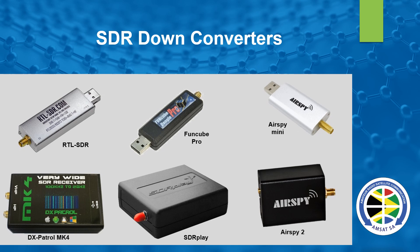You can have a whole lecture just on these SDR receivers, but it's really just a receiver. You go from your LNB, which down converts to around about 740 MHz, then you pop that into your RTL or SDR receiver, go into your computer, and you should be able to tune in that frequency and listen to the satellite. It's actually very easy — not difficult at all.